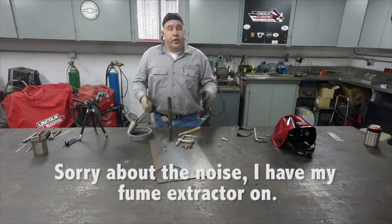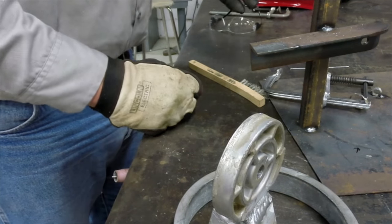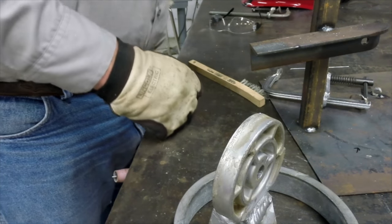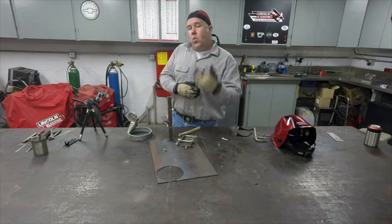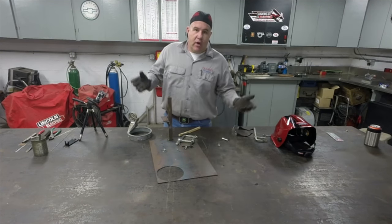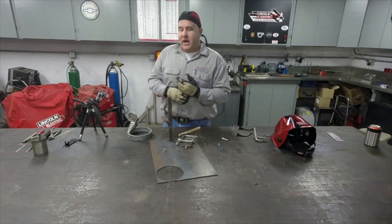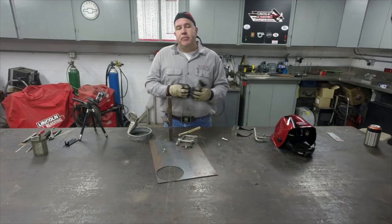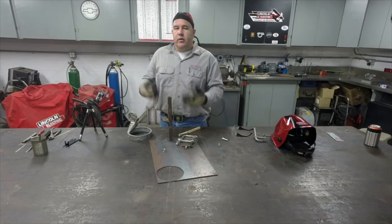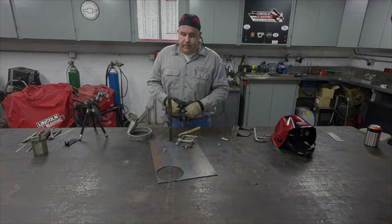Okay, good news. It looks like it welded fairly well. Next step for us is gonna be to take a grinder and or a rotary burr, and we're gonna take a good portion of that weld back out. We'll probably do it one side at a time so that it stays located and we don't take a chance of grinding all the weld back out of it and taking it off. We'll come back and re-weld it one more time. This time, hopefully, a lot of the impurities are gone. They're out of there. But I'd still like to grind it out and then re-weld it because it's a very small part. It's not gonna take very long to re-weld it.